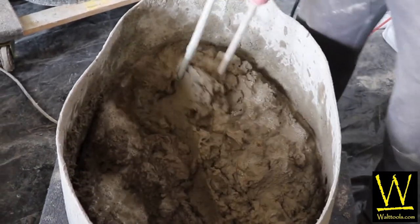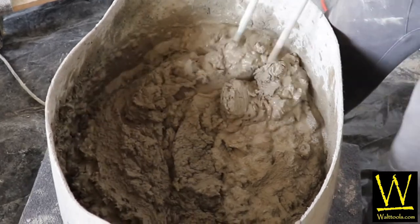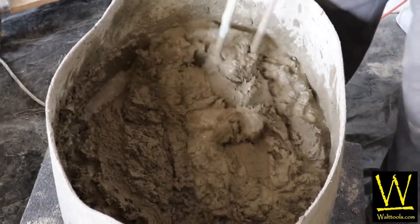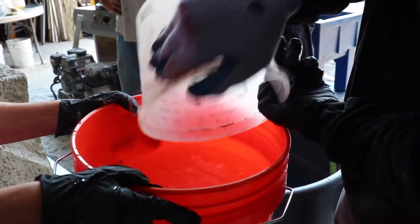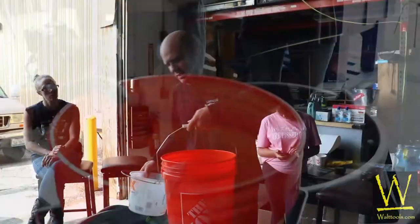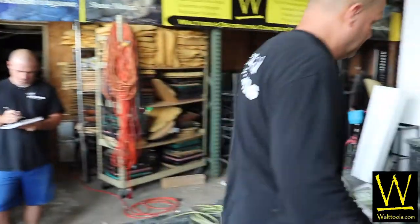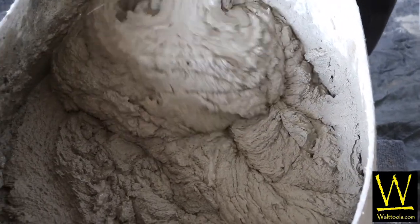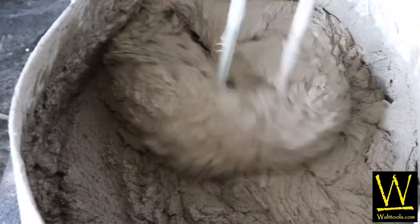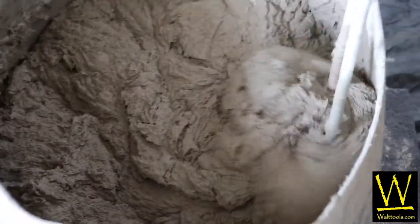Take special note of how much water you add, and whatever you've added to the load, be sure to add it to your water count for the next batch. For example, when you start mixing with one and a half gallons but you add a quart, next time just add 1.75 gallons or one gallon and three quarts. After three minutes of mixing, see if your consistency is the same — you should only have to adjust the mix with just ounces for any corrections.